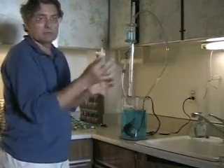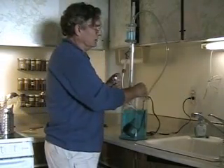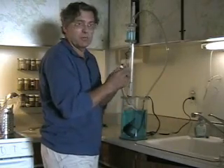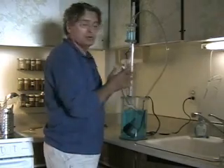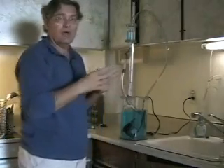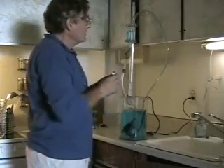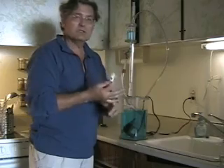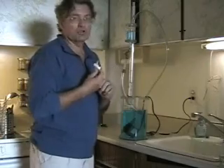This can act as a pressure detector. If I have positive pressure in the discharge line, fluid will come out the middle port once the valve is properly positioned. If there's no pressure, no fluid will come out. And if there's negative pressure, or pressure below atmospheric pressure in the top part, then air will be sucked in. So this little valve will act as our pressure detector for positive, zero, or negative — meaning less than atmospheric pressure.